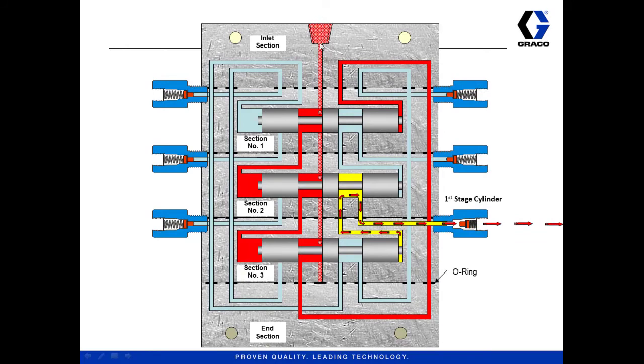The fluid pressure and flow comes in through the port on the inlet, and there's a hole that runs down the entire assembly that has pressure coming into the middle of the valve at all times. With this valve, we have all the pistons starting on the right. It's showing the bottom valve basically just finished dispensing. So now as the pressure is coming in the right side of the first valve, this is where the pressure is actually pushing on the pistons. On these other ones, it's still pushing against the right side and it's stalled out there because it can't go any further to the right.